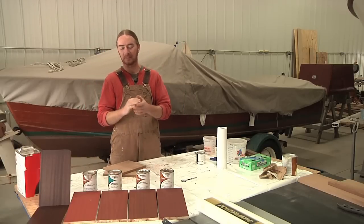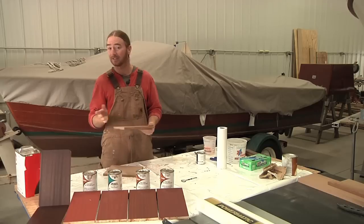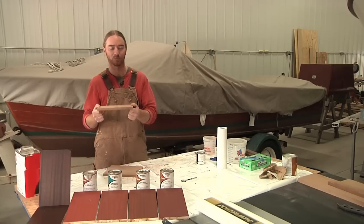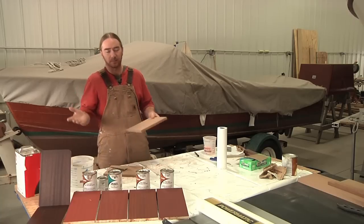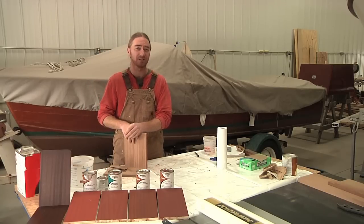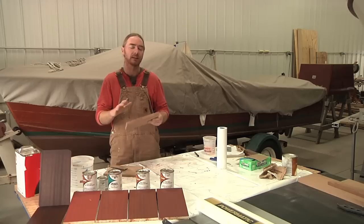It's the following morning. Before I apply varnish on the sample pieces we stained yesterday, I want to cover how I actually go about staining real wood. All of our samples yesterday were plywood — just a thin veneer laminate on top — and I handle that differently than when I'm working with thicker material or actual solid wood. The staining process doesn't change, but the way I prep the surface does. With plywood I don't typically ever sand the surface.